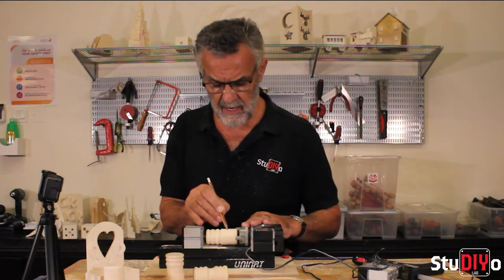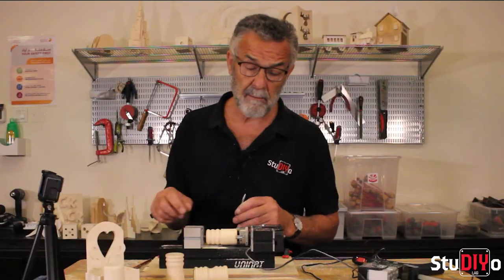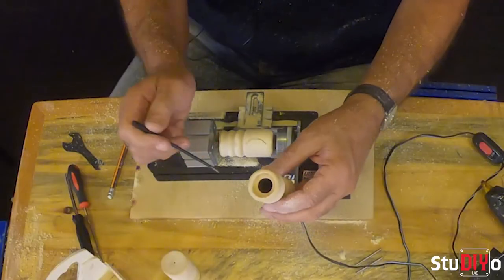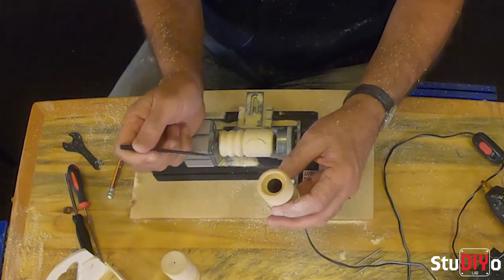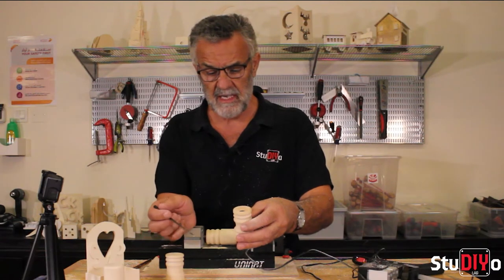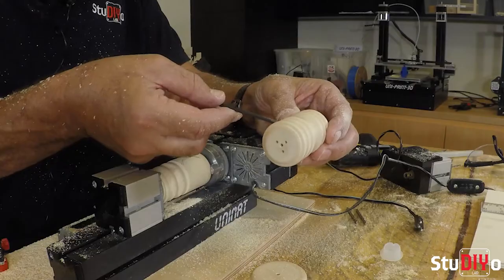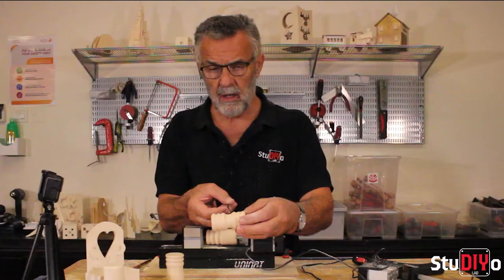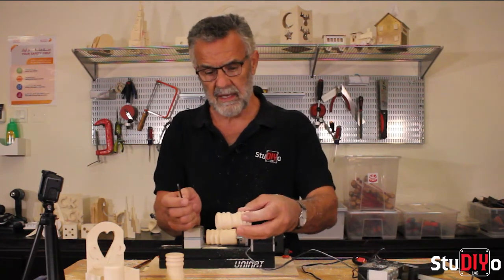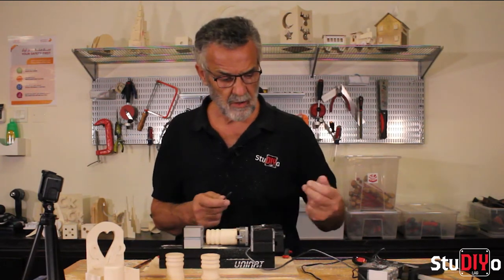On this area I'm going to make a big scoop — a big cutout. Remember that going through our piece of wood there is a hole, parallel all the way down. You get an idea of its diameter when we issue you the blanks. That means I have to be sensitive to how far I dig in — go too far and that's going to fracture and break the wood. So be conscious of that central hole as you're turning.